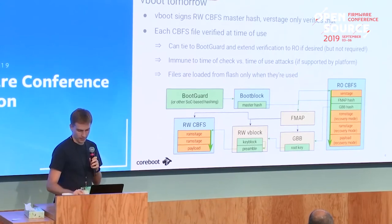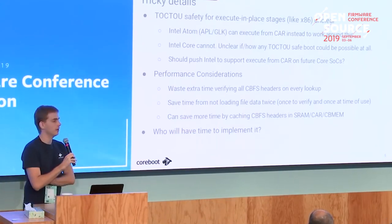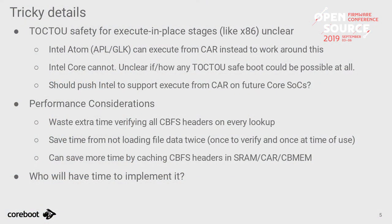This proposal works great for ARM but has some problems on x86, because those platforms execute early stages in-place. Execute-in-place is a problem for time-of-check versus time-of-use protection because the SPI controller memory-maps your code - when executing an instruction, the SPI controller fetches it and uses it simultaneously. There's no point in between where you can get in and hash something. You could try to reason about cache behavior since the SPI controller usually loads into a cache, but that depends on exact cache lines and architecture, and the information to guarantee it works isn't freely available.